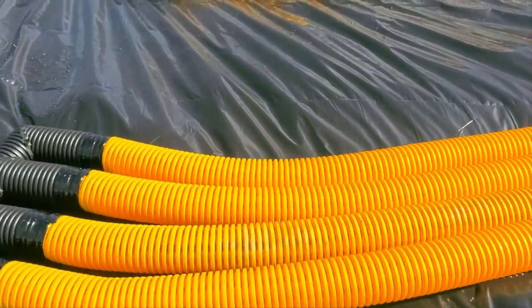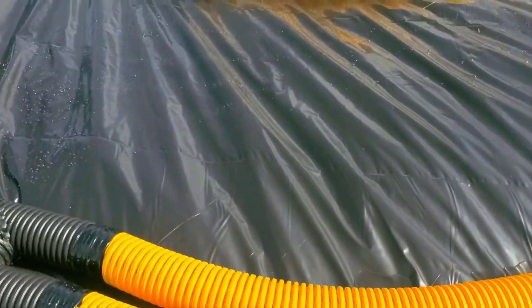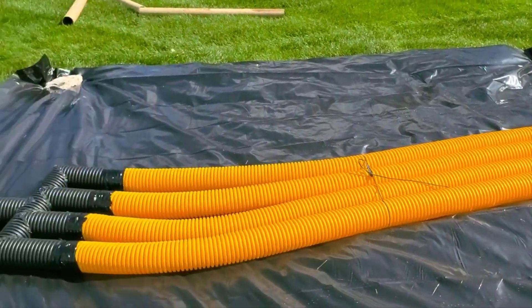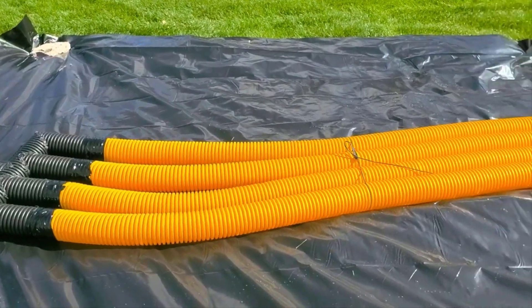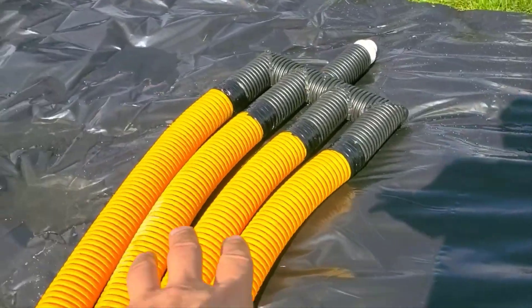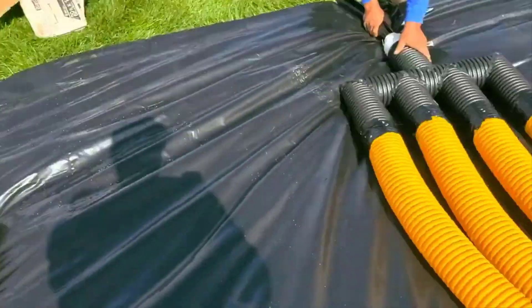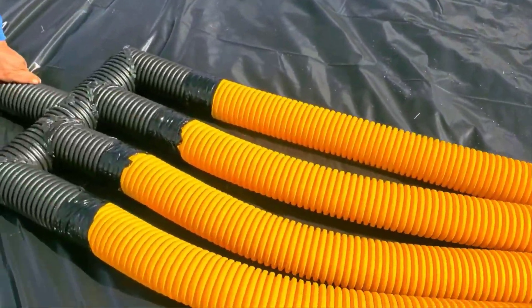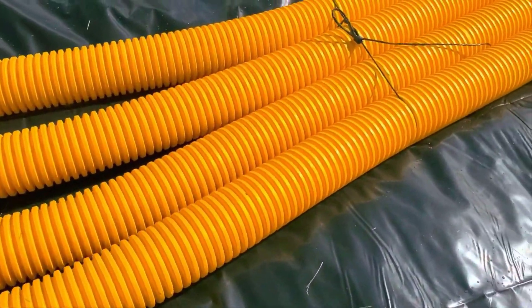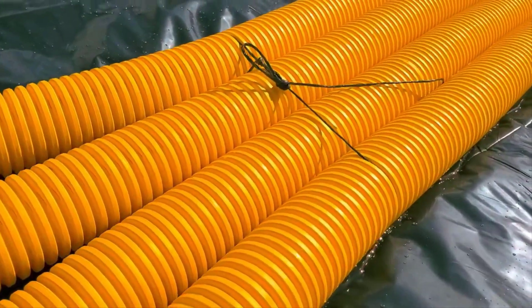That's a collection pipe, not a dispersal pipe — now you see why. The idea is you want the water to travel through the leach field and be dispersed throughout a large area; that's how a leach field works. With this pipe just dumping the water like that, you'd get your lawnmower stuck there. Now, knife cut lives up to its name — it doesn't have any material removed, it literally just has cuts in it that you can barely see.